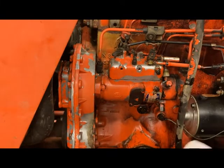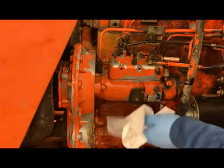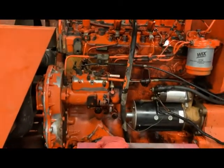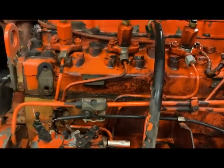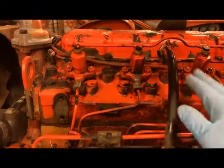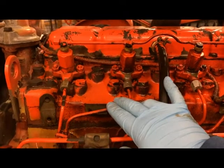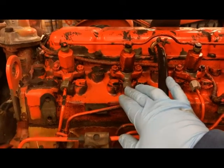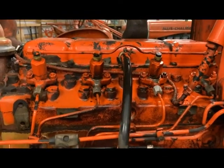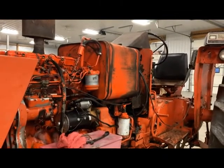Just dry up some of this mess — we're going to hop up there on the tractor and hopefully she'll fire. If you're unable to get it to start after you bleed the air out on the injection pump bleeders, the next step is to crack open your injector lines going into each injector. There's four of those — I disconnected three out of the four just because they were easy to get to. You'll turn the engine over until you start seeing fuel come out of these lines. Basically, that's just getting that air popped out here instead of trying to throw it through the injector. Once you get to that point, you should hear the motor start to try to fire up, and then you can tighten those back up. So that's where I'm at right now — it hasn't started yet, but it should be starting here in just a second.